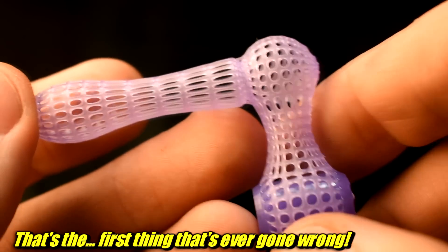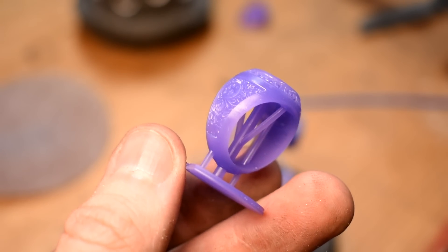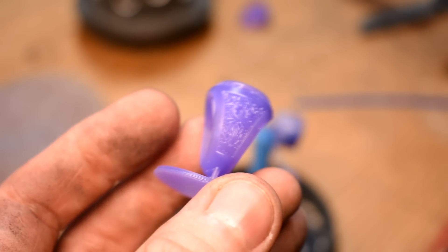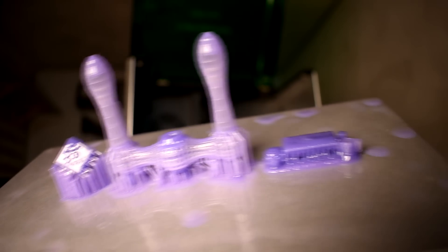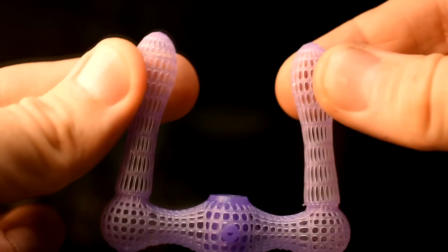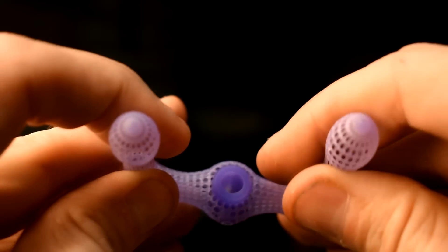Well, there's one major benefit of this Monocure Burn Away stuff: it's super nice to print. Somehow, through witchcraft probably, this resin has no wax in it. You might think without wax it should print like any other plastic resin — yes, it does. This is super nice stuff to print. This is all the support material it had and it still printed this nicely. I'm very impressed by how durable these prints are. It's probably not as tough as the ABS-like resin I use for other stuff, but I'm not going to accidentally break the thing just holding it in my hand. It's kind of rigid, and if I push it too hard it's definitely going to break, but it's certainly not made out of glass.